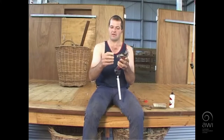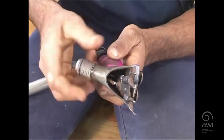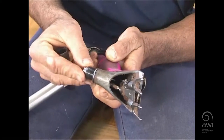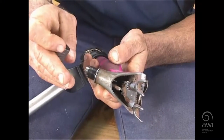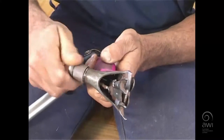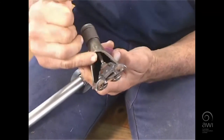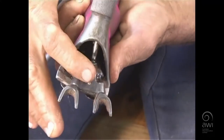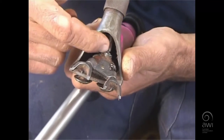Up a little bit further, this is what we call the tension nut. Inside the tension nut, we've got a safety clip or safety spring. And then we call that the sleeve. Inside that sleeve, we've got the giggle pin, which goes down to what we call the fork yokes — that main piece that sits inside of the handle. There's a spring in there holding the giggle pin in.